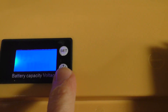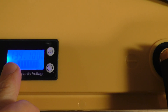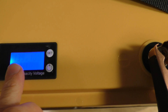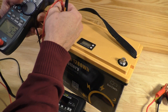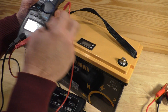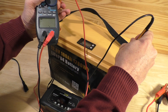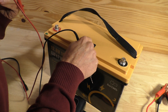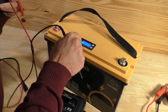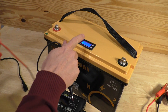I got the battery charged up. It looks like it's displaying full, saying 13.9 volts. Let's go ahead and test it with the multimeter to double check. I'm set at DC. We'll hit the terminals — it's giving me 13.85 volts. Let's retest: 13.8 volts. So the LCD display is pretty accurate in terms of the voltage reading.